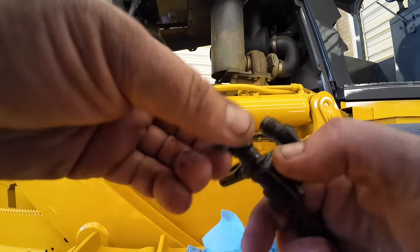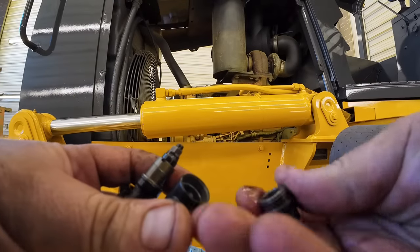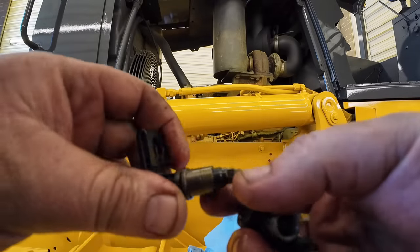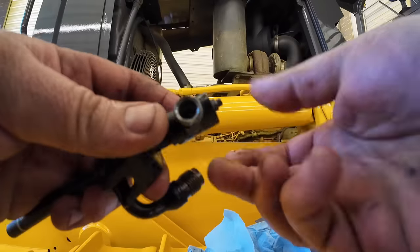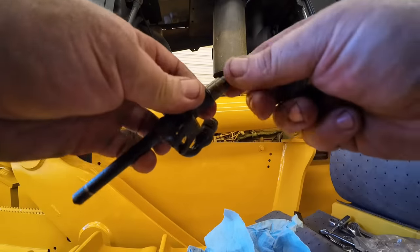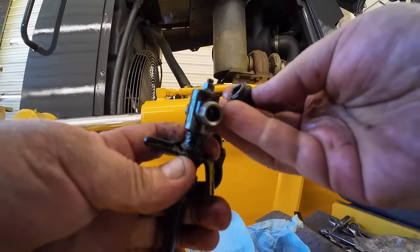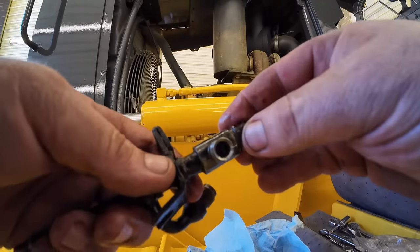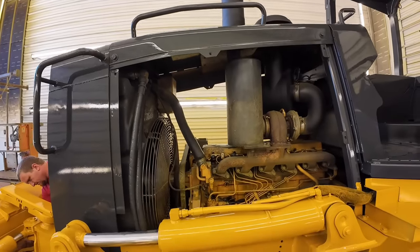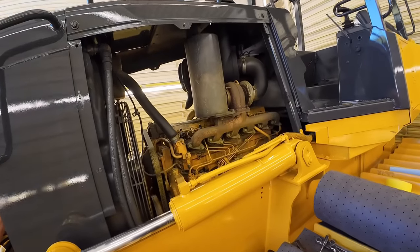All right, got that injector out, got the new one in there. Everything's looking good. I took this top hat off here, I'm gonna show you, if you guys can see. Somebody's been cranking on that thing pretty hard, and it had metal debris in there. They had a leak, something going on there. Anyway, these things are super inexpensive. I think you call these a pencil injector. They're a very simple thing. I don't think they even rebuild them. At this present moment, they just get new ones, but I don't know who'd been in there cranking on that thing, but that was part of our leak too. So I think when I got in there and fixed that one leak and loosened those fittings up, it must have messed that seal up I had cranked down there. But anyway, everything's all good.